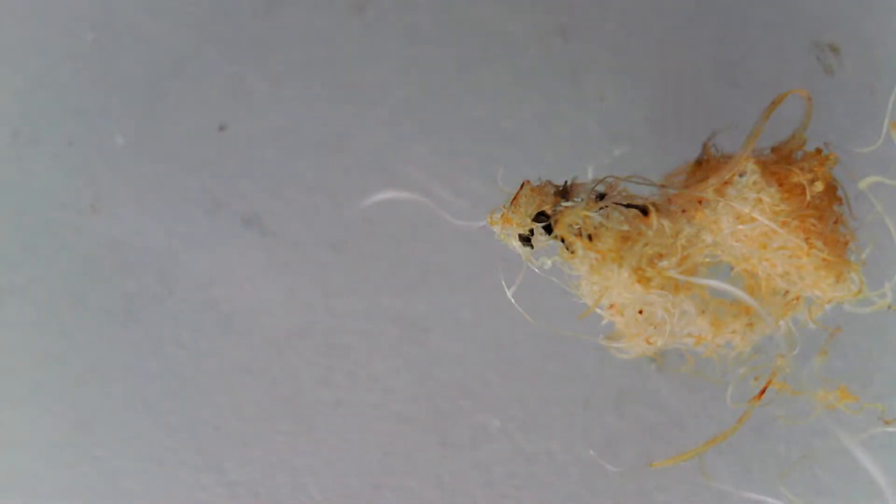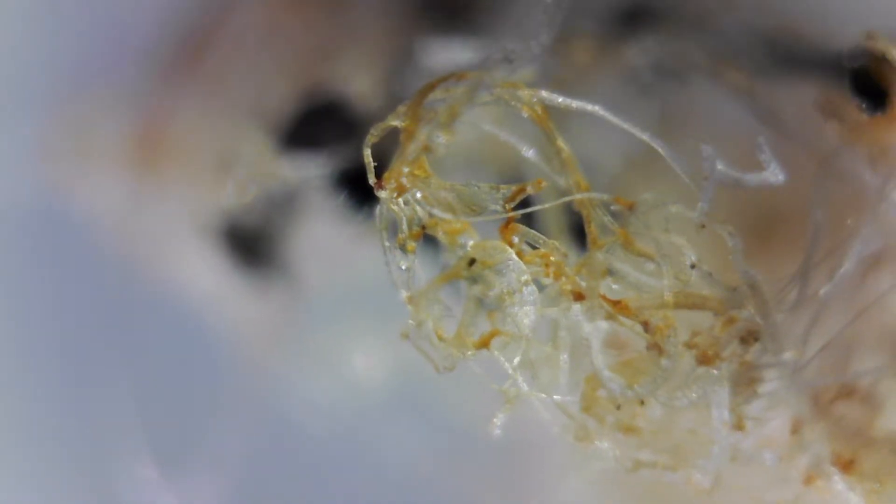Here I'm just magnifying in and you can see some of that orange rust-type color. I have to zoom the USB scope up and down because of the difference in height. Here are some trapped particles — I believe some of that is actually just iron from the casing of the well, because I've taken a magnet and this stuff is magnetic. You can see these clear, fine tubes that it grows in, and then orange develops on it later.